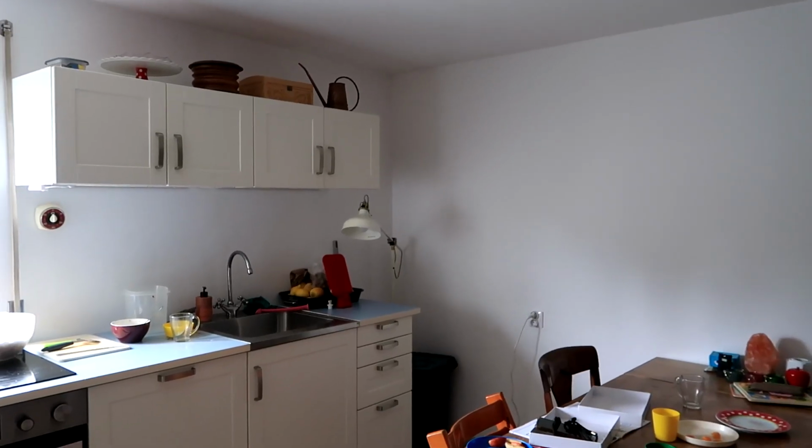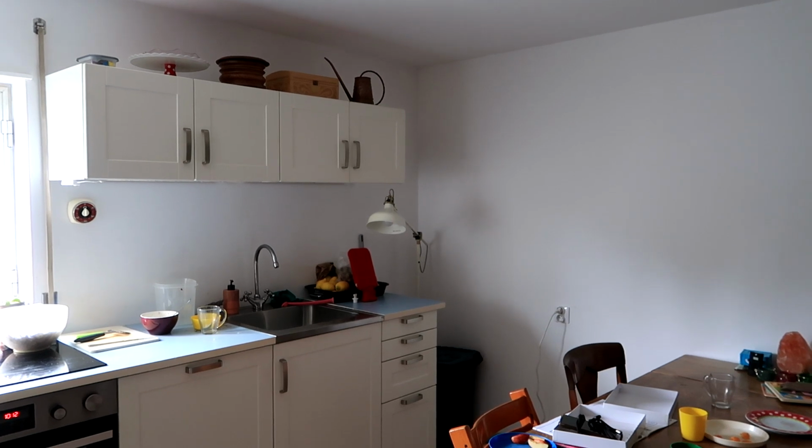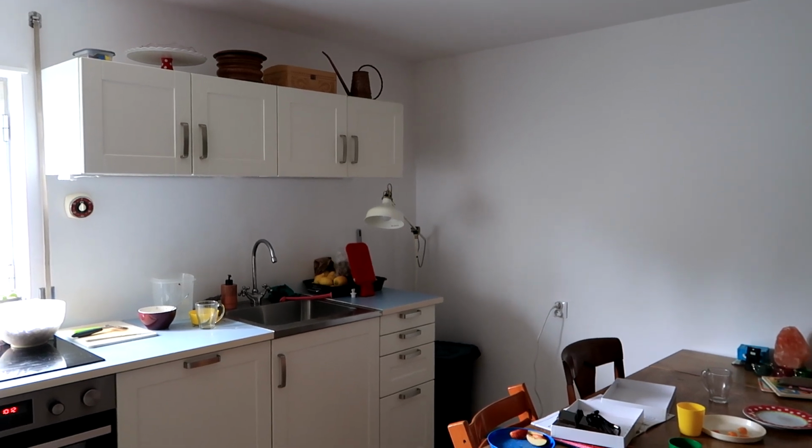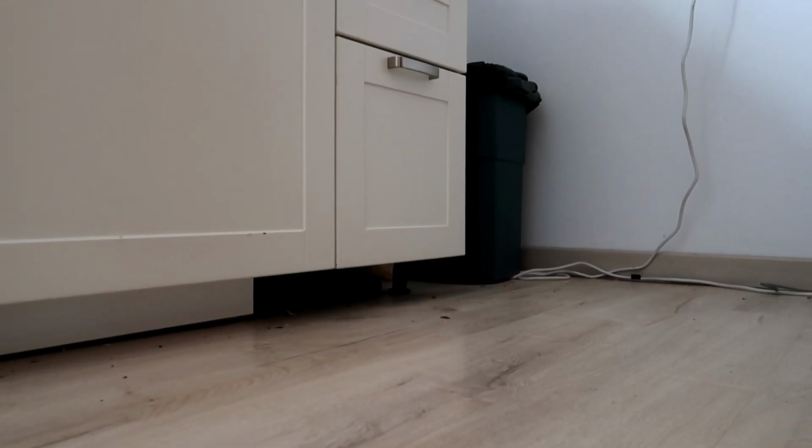Now the height of this room is about 10 centimeters shorter than the height of the closet. So we need to take that height down. Plus the closet normally stands directly on the finished floor, and we want it to stand on feet, just like the other cupboards of the kitchen. So we can continue the skirting underneath the custom cupboard. Now let's see if we can shorten these panels.